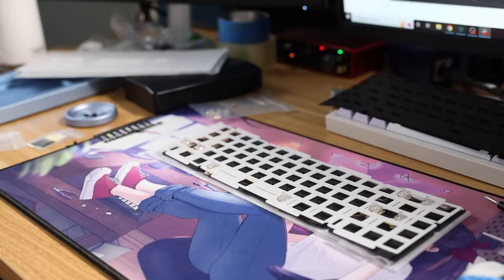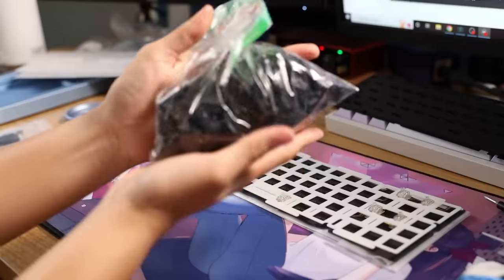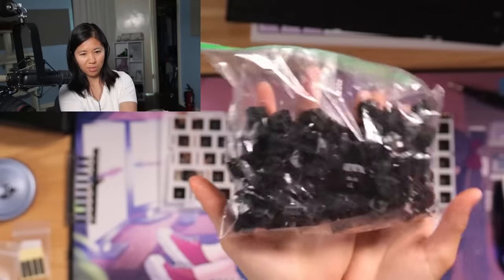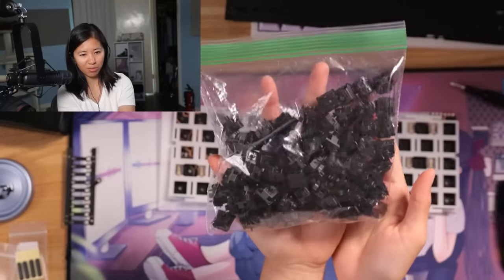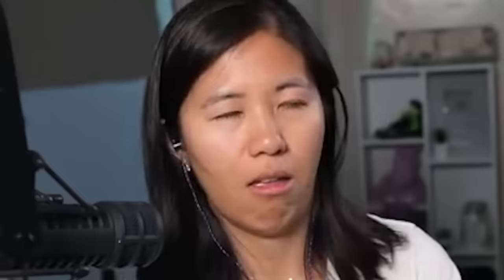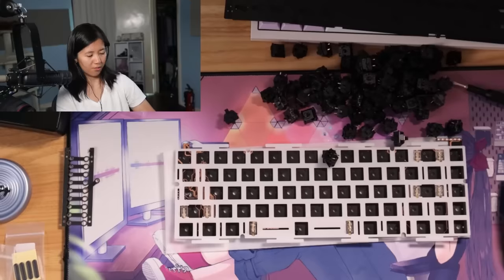No standoffs makes things difficult. For the switches, I decided to go with something I never ever go for — I haven't done anything with these switches in a long time. They're all black housing, all black stem — Cherry MX Blacks with a spring swap to a lighter spring weight so I can actually use them without my fingers getting tired. They are spring-swapped and hand-lubed by me. Very usable, and they sound fantastic. I'm really excited.